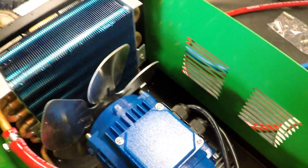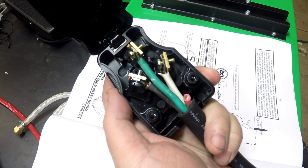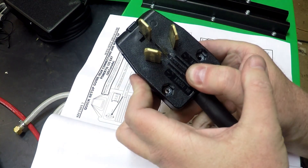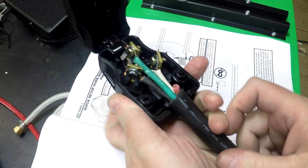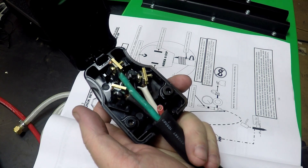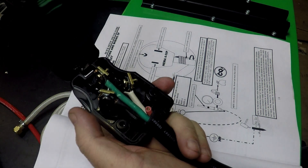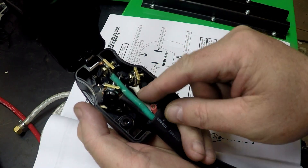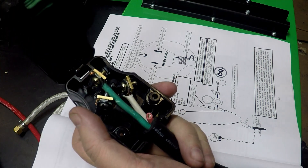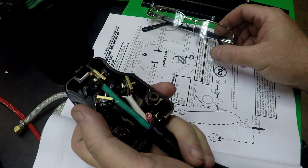This is how they want you to wire the plug. I'm using a 50-amp dryer plug — I use the three-blade style in my shop for 220 items. It comes with a nice four-conductor, I believe it's an eight-gauge four-conductor wire. Interesting that it has a fourth wire because they say they don't have a three-phase version of this. Right here it says: one phase, or for three-phase or 460–480 volt use, consult electrician.